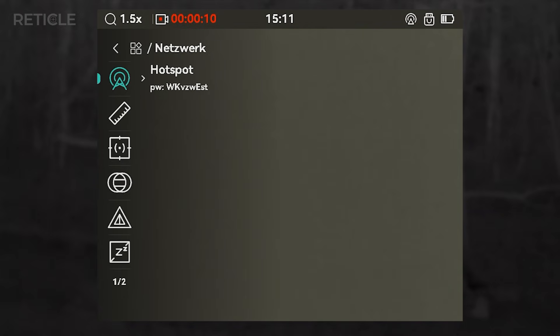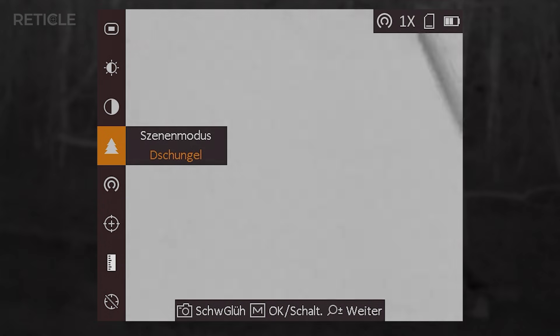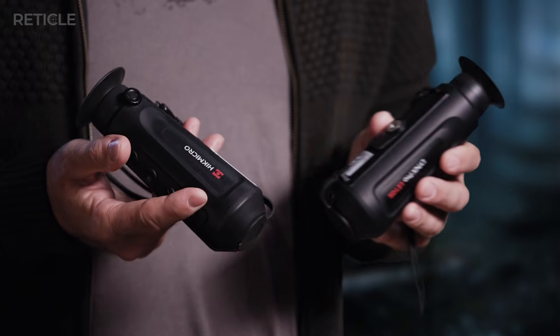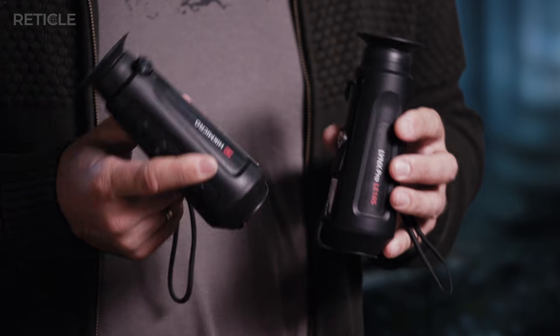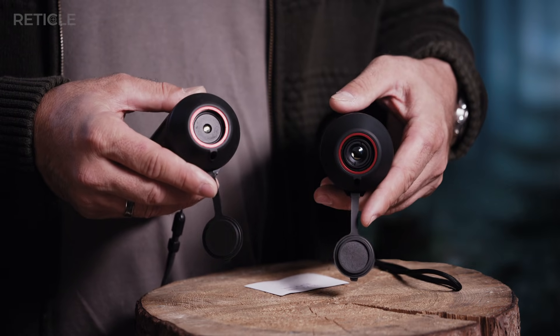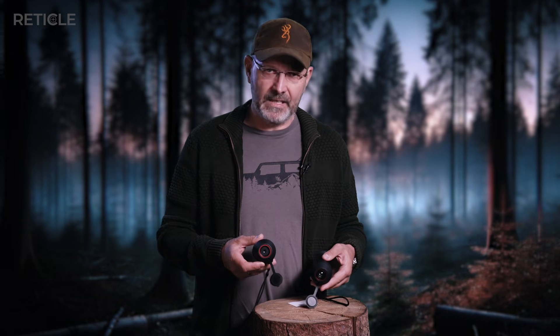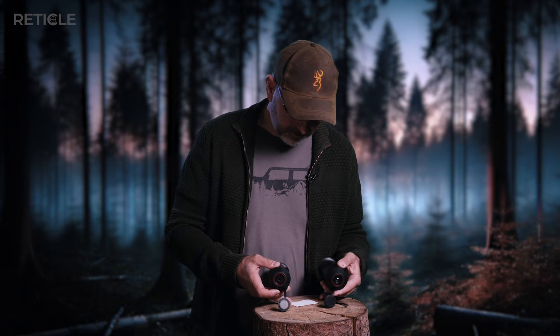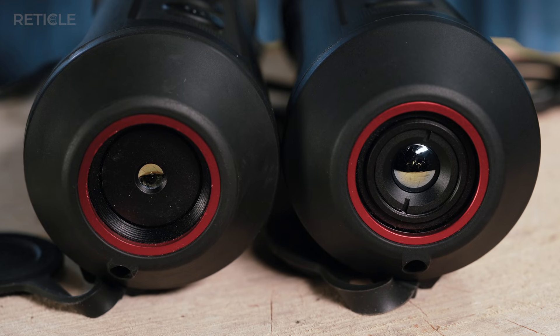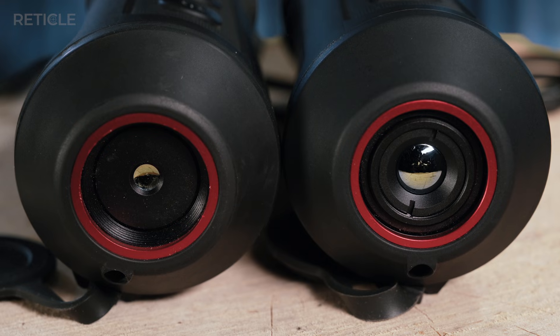Quick note on the menus: the LE-10S has sub-menus, so you're not stuck scrolling through everything you don't need. The LC-06 dumps all settings on one page. Physically, both devices are basically identical — IP67 rated, so they'll handle rain just fine. The LC-06 uses a 6.2mm lens; the LE-10S has a 9.7mm. When you do the math on horizontal resolution times pixel pitch, the sensor chip on the LC-06 ends up being only 2.72mm, and the LE-10S is only 3.07mm — both are tiny. Those small germanium lenses help keep the price of these items low.